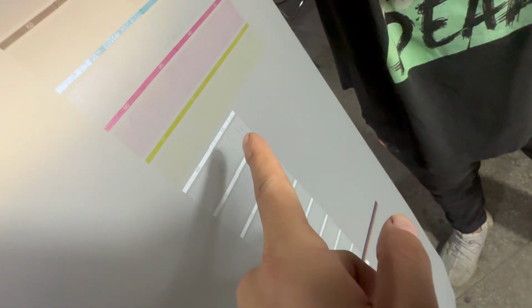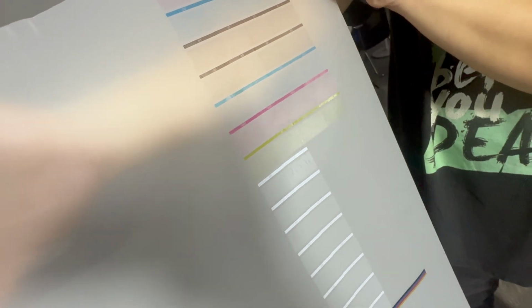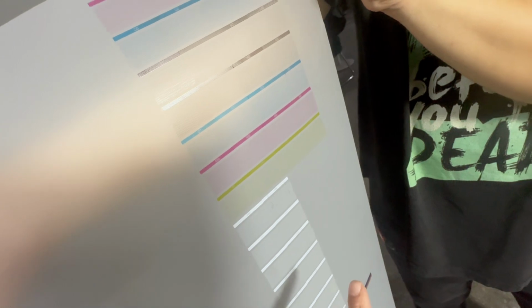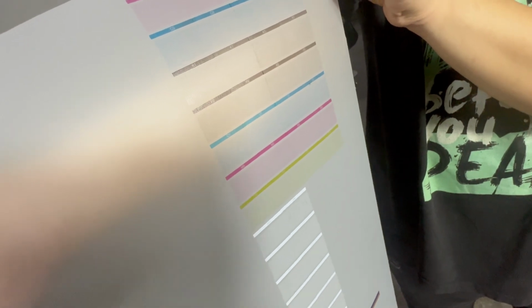But the white ink has a little bit of bubbles, so we need to do small flushing again, or negative and positive active cleaning. So this is the procedure to do the load, the nozzle check and the cleaning job process. Anyway, we must be sure all the nozzles for white and for color are over 90% coming out. Then we can start the printing job and alignment.